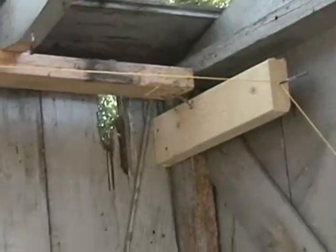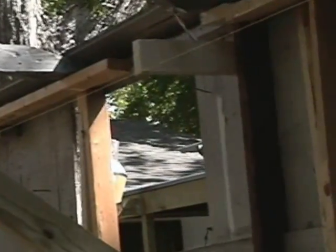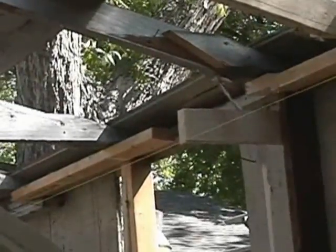After we get through with that, as you can see, we have a string line up there. We come out 12 inches from the wall, go down to the other end, come out 12 inches from the wall, run our string line down to the center, and pull it tight so that we can get the wall straight. That's a little more than what most people will do, but since this is one I'm going to be using for years, I just want to make sure everything's straight. That's about all we can talk about until next time when we get ready to pour our foundation.